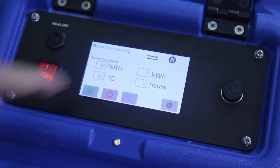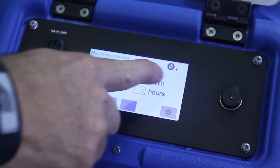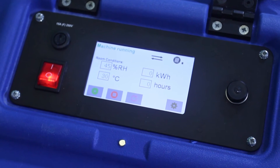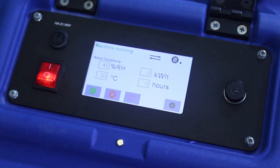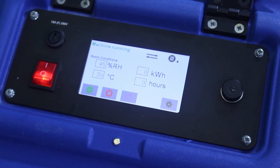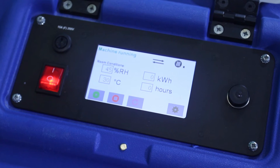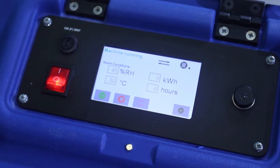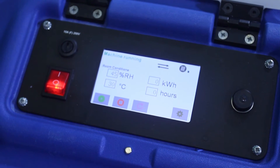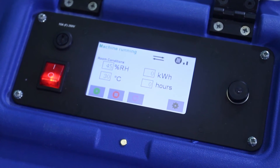What you'll see on screen is two arrows running back and forth — that means it's in exhaust mode. You'll also see a little black dot come up every 40 seconds until you have full bars, which means the heater is fully engaged. At the moment, only one bank of heaters is lit up. After exhausting is done, the arrows will go in a circular action, indicating recirculation mode. Two arrows back and forth equals exhaust mode; circular arrows equal recirculation mode. We have four bars in total to hit before it's at full heating capacity.